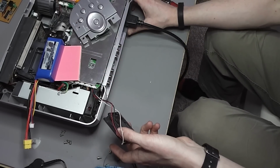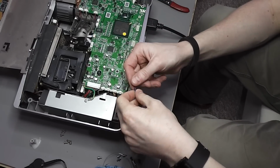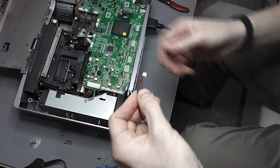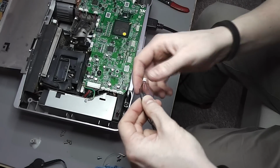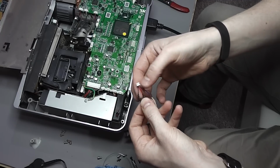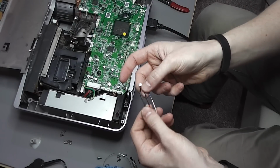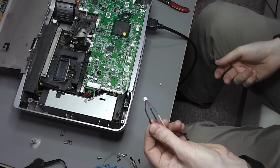I'm just taking a look at the power on these pins, and getting 12 volts on the end terminal, which is blue here, on these three. The black is definitely ground, and that matches up with other ground points on here, so I'm happy with that. I naturally assumed, possibly wrongly, that red was going to be positive, which is why I wired it up like so. But I'm getting a solid 12 volts on this blue connection here, and only 1 or 2 volts on here.